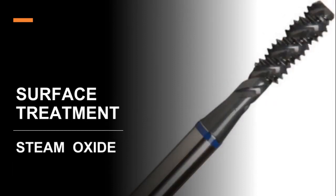Steam oxide — a black oxide surface (Fe3O4) produced on the surface of a finished tap by means of a steam furnace. This oxidized surface is porous and helps retain cutting fluid in the working portion of the tap. The materials on which steam oxide has shown improvement in performance are stainless steels, steel forgings, tool and die steels, hot and cold rolled steels, and high nickel alloys.